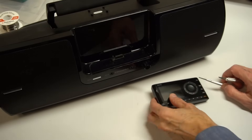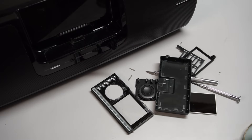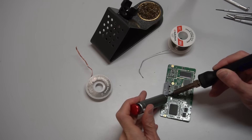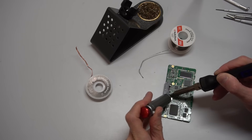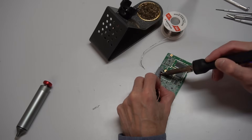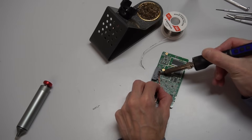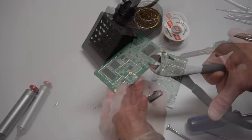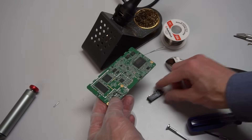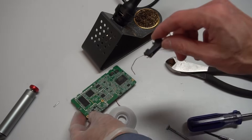So, the radio module would have to be sacrificed so I could grab its connector. Initially, I tried using a solder sucker to get the connector off, but that didn't work. Next, I tried soldering wick to try to suck up the solder, but that connector was just welded in too tightly. So, in desperation, I snipped it out as carefully as I could with my wire cutters, my go-to tool when all else fails.